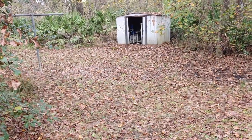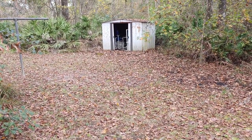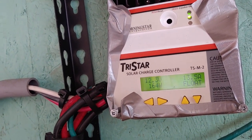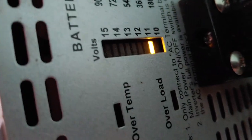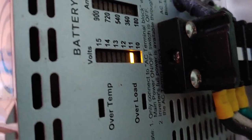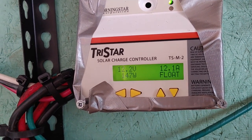It's now running — probably from the aerator into the house, even though I can't really tell from over here. So we're still waiting for the second one to come on. This reads 12.3 volts — just plenty. But the inverter over here is showing down to about 11, which is quite a discrepancy. Because if the inverter thinks the voltage is down under 10, it will turn this off — even though we have plenty of voltage according to the charge controller over here. It's still blinking green and says we have plenty.